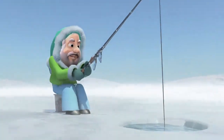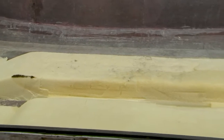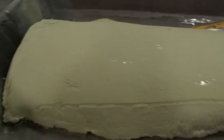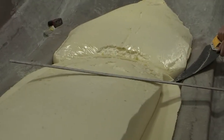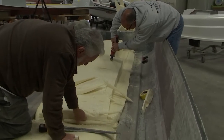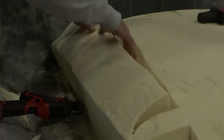Welcome back aboard. What you're now seeing is our two-part flotation foam that has been groomed, managed, and leveled into the hull bottom of Taylor White's boat at Matan Marine Restoration with Mike Borelli. I've never seen anybody use two-part polyurethane foam in conjunction with vacuum before, but it was amazing — the density and consistency of the foam was exceptional. Using a handsaw and reciprocating saw, we cut the foam height down to the stringers. When you put foam under vacuum, it takes all the air out of the environment, producing a more dense, void-free foam.